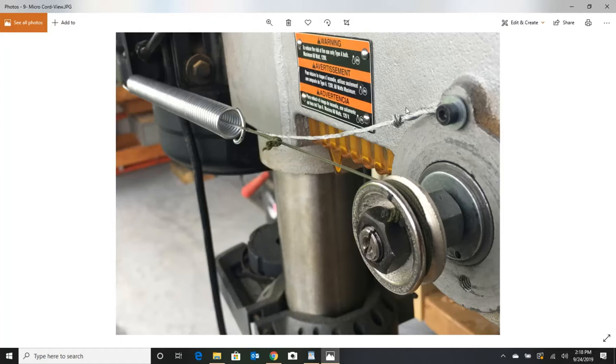If you look closely, I did maintain some stainless wire for safety purposes. This wire goes through the spring and wraps all the way around — I'll show you that in another picture. This is for safety: if this cord ever breaks or the spring ever breaks, we don't want that spring hitting us in the eye while using the drill press. This safety cable is just like a garage door spring — it goes right down the center. If anything breaks, rope or spring, this is going to lurch forward an inch or two but it's not going to go anywhere. So you will need some picture wire for that.